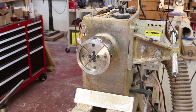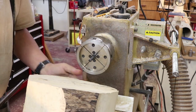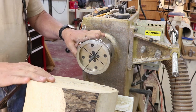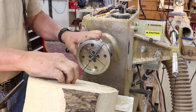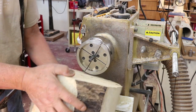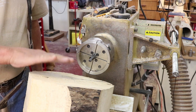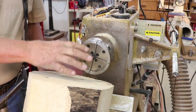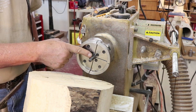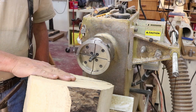Tighten that down very well - this is really my favorite way of attaching a bowl blank to my lathe. Word of caution: I'm going to show you the way I do this, doesn't mean you have to do this. I got a comment from somebody that said this is probably kind of dangerous. I'm going to turn my lathe on and screw this piece of wood on while the lathe is turning. This screw sticks out a good inch and a quarter from this surface, and I'm not going to bring my tail stock up.